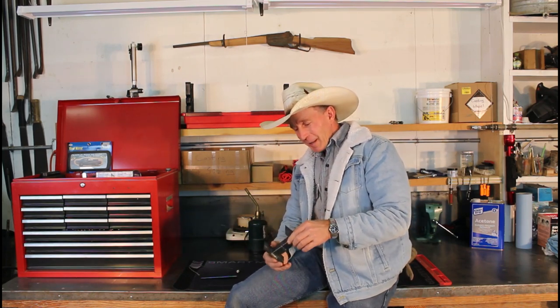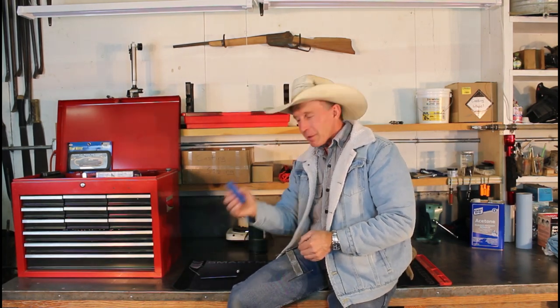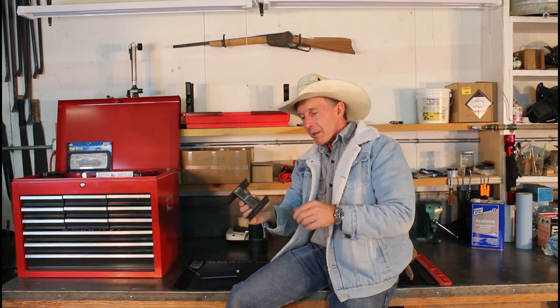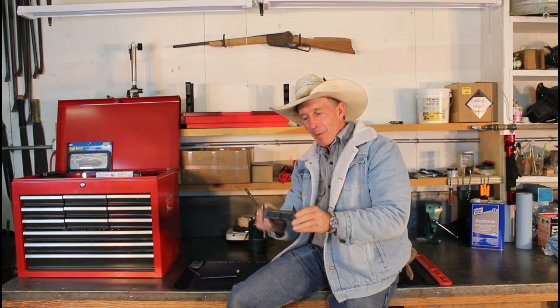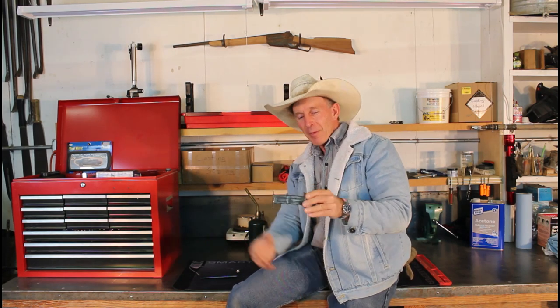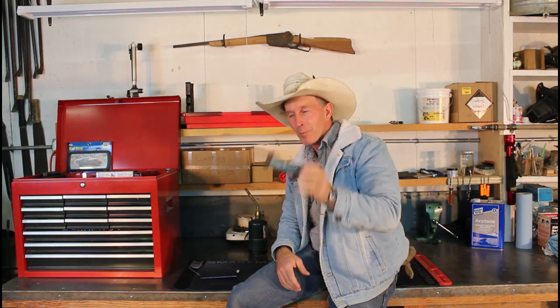This is kind of a rite of passage. We've been working on all sorts of different types of joints. Last week I got assigned this box to build. We took some of these pieces of steel — sixteenth inch thick and one by four — we've got ten of them. We welded a couple together on one end and a couple for the other end, and then had four of them to make this box. While it was still hot, we threw it in a tank of water. As it cooled, it creates a vacuum, a suction. So if there's any flaws in the welds, that water will go through and your weld fails.